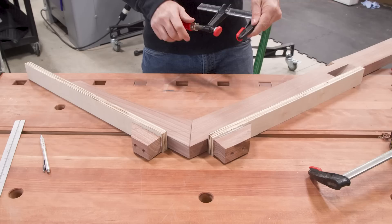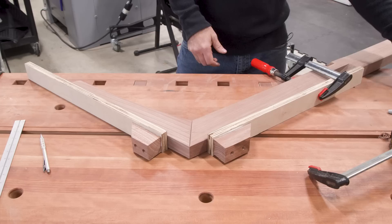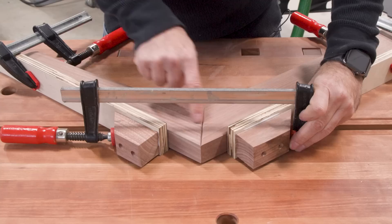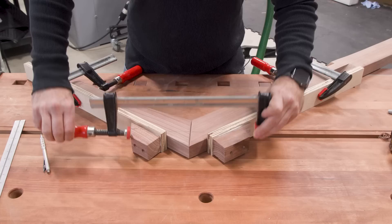On each side I'm just going to add a small clamp. That's the joy of using the sandpaper — it grips so well you really only need one clamp. If you decide to skip the sandpaper you may want to put two clamps on there just to be sure it doesn't slip. Then all you need to do is add your third clamp across the joint and try to keep the bar in line with that center line. The nice thing about an F-style clamp is this little swivel pad that's going to wiggle and find the angle.